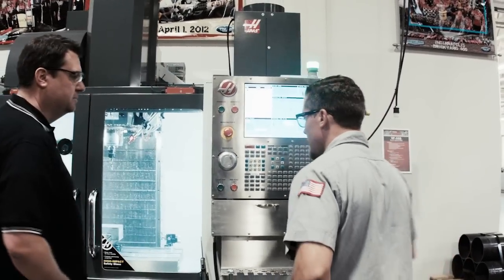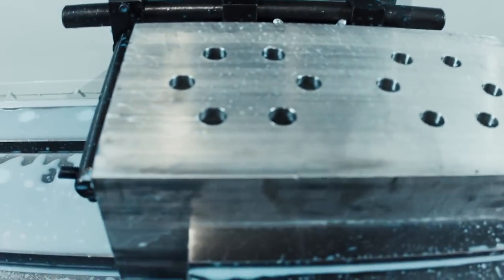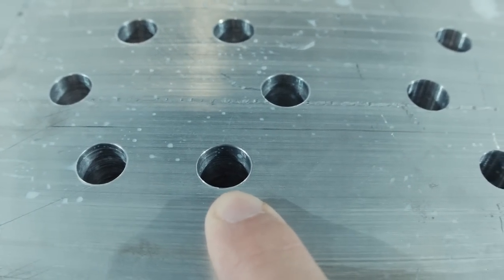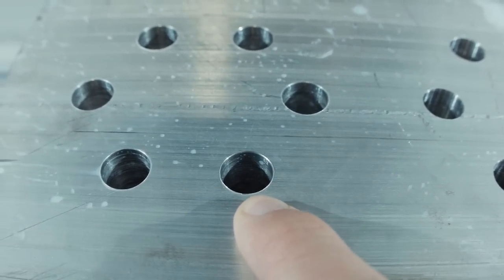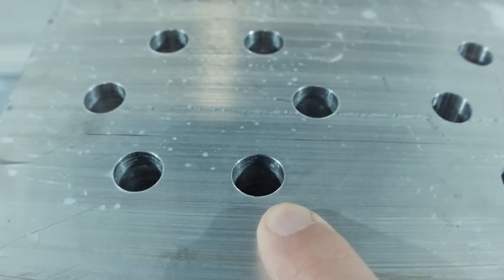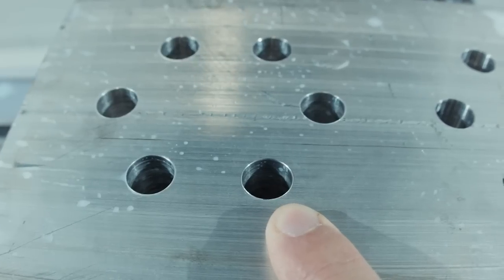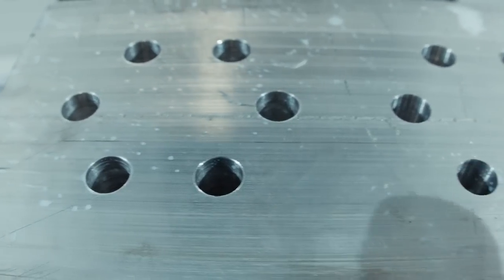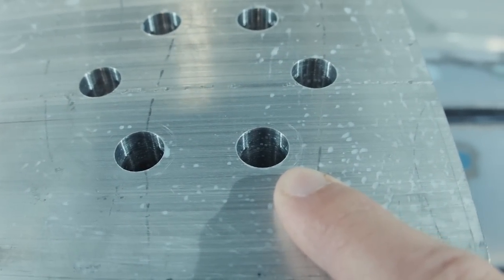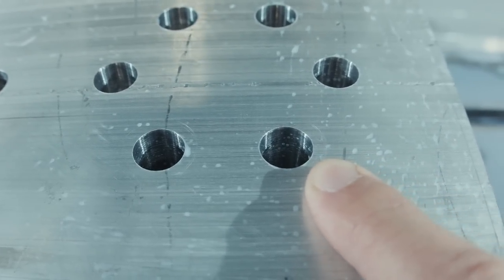Let's take a look at the hole quality. So let's take a look at that first set of holes — tell me what you see there. Where we used the high-speed steel, you can actually see that there are some tool marks, so the finish isn't very good. And also on the top, you can see that the hole is bell-mouthed, proving that we should have used a center drill to prep this hole. When we look at the holes with the through spindle coolant and the carbide drill, we see a much better hole, much better finish, and you don't see that bell mouth.